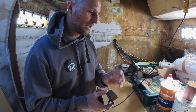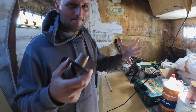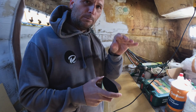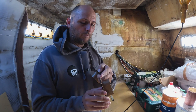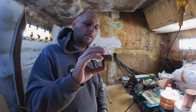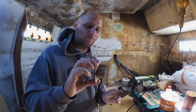You can get a hole saw, drill a hole, put a carbon tube in it — the carbon tube is a bit long — and then laminate the skin to the bit of carbon tube that sticks out each side. Nice and easy, and we used that a lot on the last race boat project. In this case, I don't want sticky-outy bits coming out of the bulkhead — I want it quite flush. So to get the skin tie to happen, I've got a capped flange that goes through the bulkhead that way, then a bit of glass sticking out the other side, sand it flush, then make another one coming the other way.